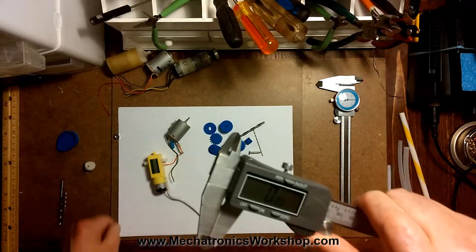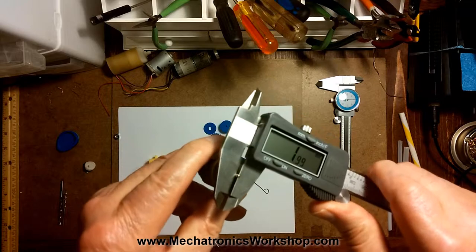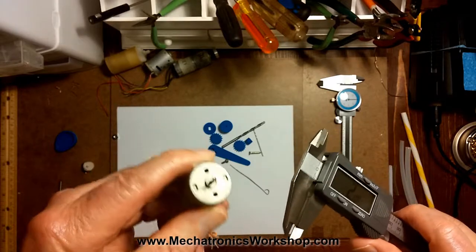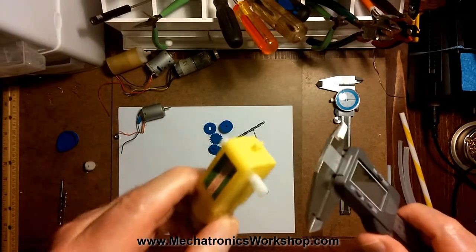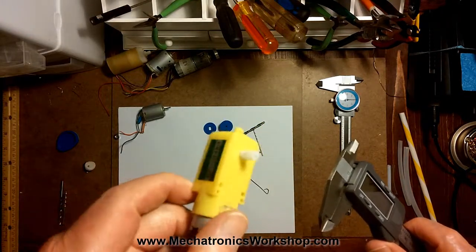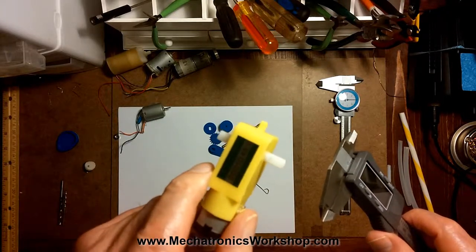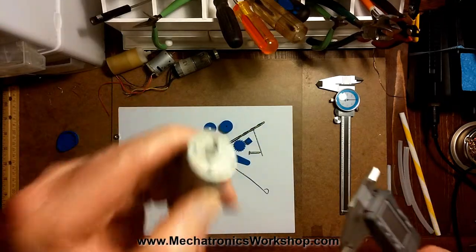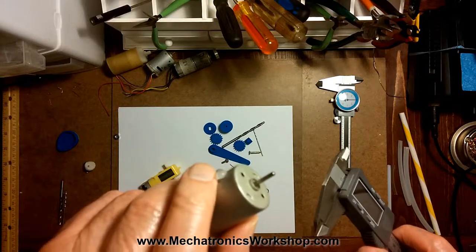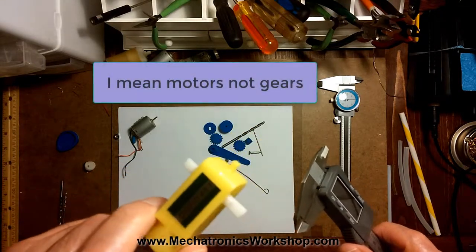Probably some of the most common things for me would be motor shafts. I just want to know what diameter that shaft is — that's two millimeters, 1.99. So now I know what kind of gear I need to use for that shaft. Here's a real common hobby motor and this one's got oblong shafts on it. They're great because they'll hold a gear or a pulley and keep it from slipping, as opposed to round ones where you actually have to use a set screw or a press-on gear, pulley, or collar. So the oblong one is really nice.